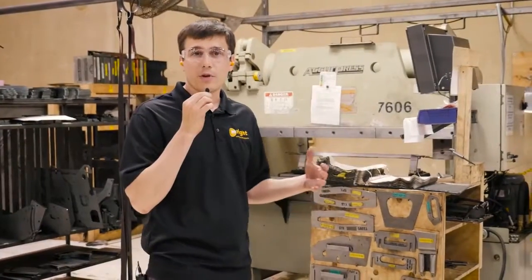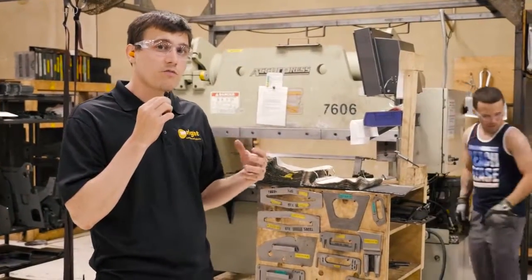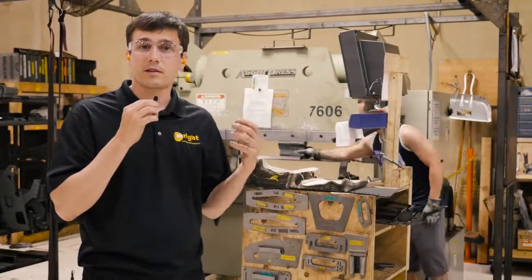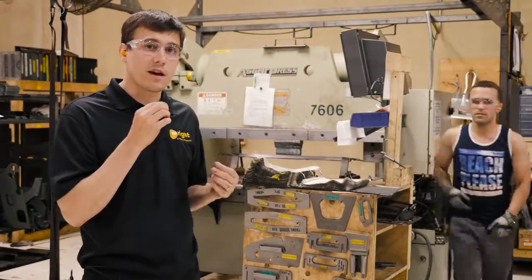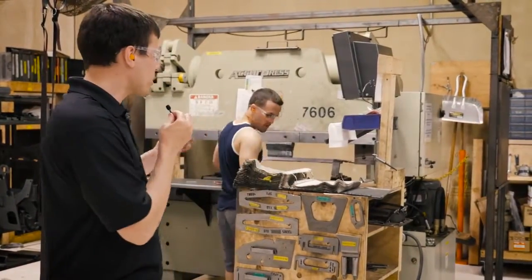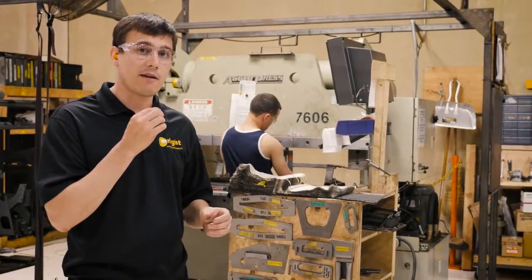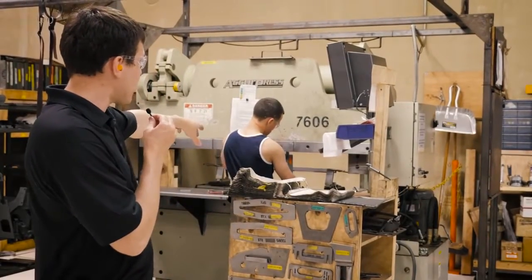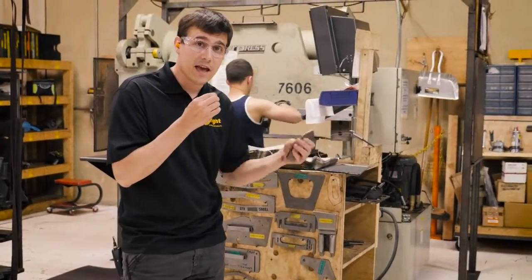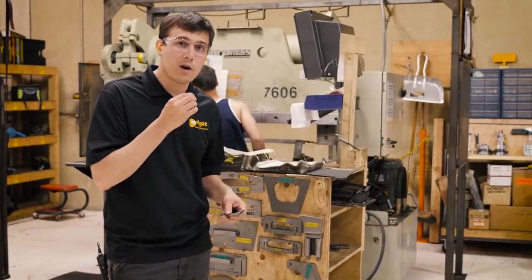So one thing that's unique about how we use our brake presses is these guys are really tool change masters. When we set up a part, we actually don't run very many all in a row, and that's because we're a high velocity factory. We're building a lot of mowers in a small area, and those machines don't sit in our factory for very long. Once we start the process, that mower goes to the truck right away. So these guys are doing quick changeovers. That means that we're not going to inventory up a bunch of parts. We're just going to make exactly the parts we have for that order. He's changing over the tooling right now. When he runs his first part, sometimes even every single part, we use a checker like this. So we check the angle every time. That means that we don't have defects that end up in weld, and we end up trying to rework it or something like that.